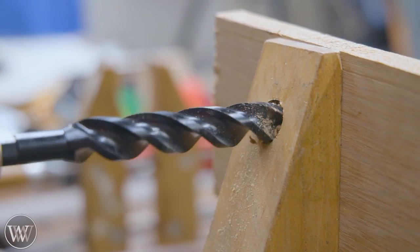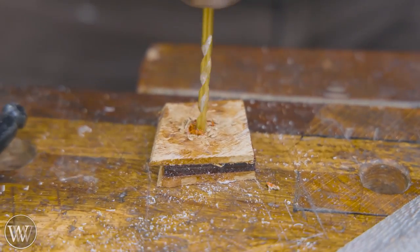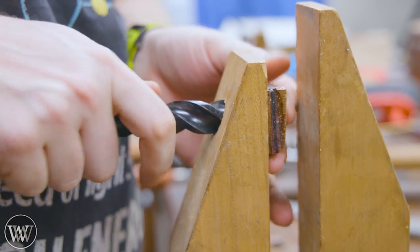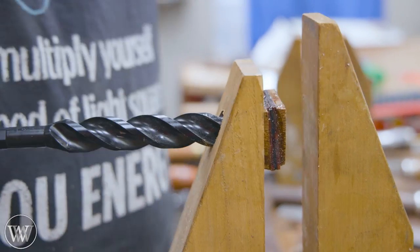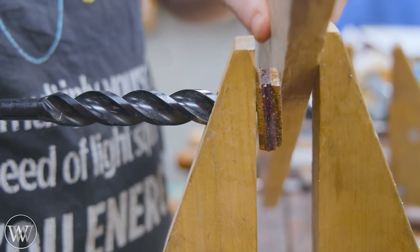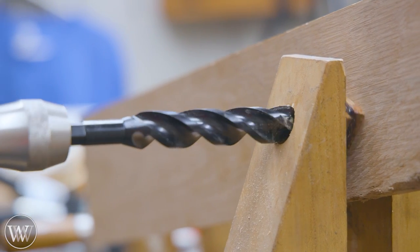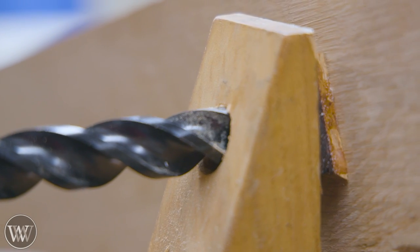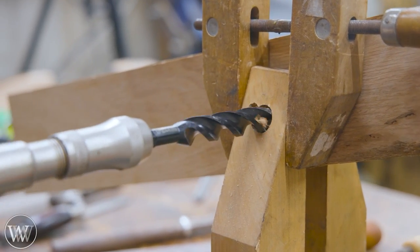I'm also going to drill a hole through my hand screw vise into the ring. It's very important that this be solid, so I'm going to use a pre-drill of an eighth inch hole all the way through so that the lead screw on the auger bit doesn't split it out. We're going to work it down in there and put a block in back for it to go into, so this whole thing sandwiches together and I get a nice clean straight hole all the way through without it splitting out. Then I realized it was just going to rotate inside — I squeezed it down more and it still rotated. I put another clamp on there and that actually held it and kept it from rotating.